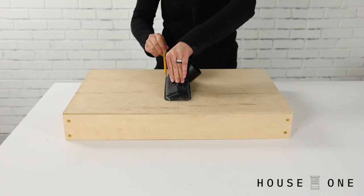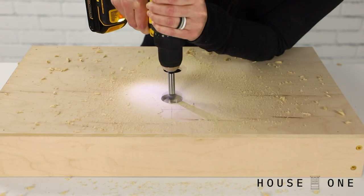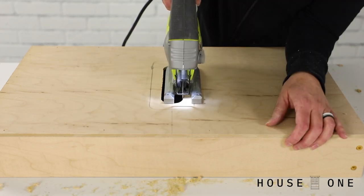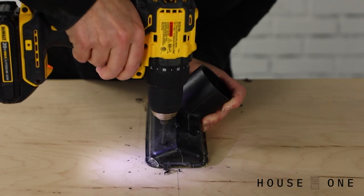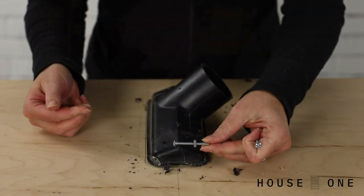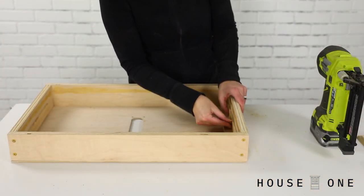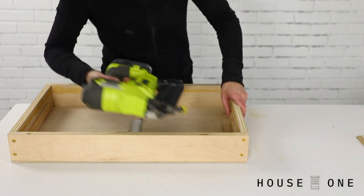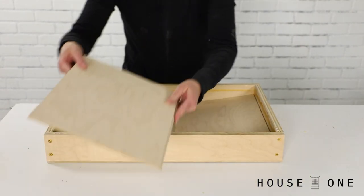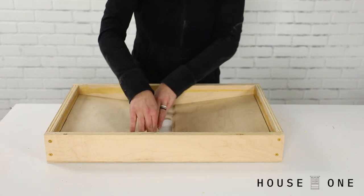Now I could use my vacuum attachment to size the opening on the underside of the box. I used my drill to cut the ends of the opening and a jigsaw to remove the rest. I drilled holes through the corners of the attachment and the box and dry fit the installation with bolts and nuts. I then decided to attach some scrap ¼ inch plywood strips and angled wings inside the box to divert the sawdust to the port and lessen the open area inside the box to create more suction.